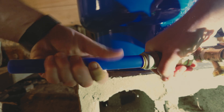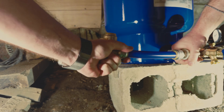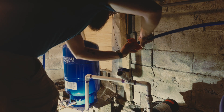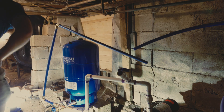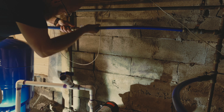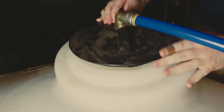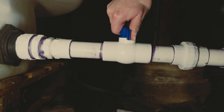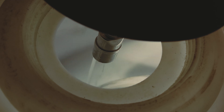I'm using PEX to go into the house. I have to double back because the house inlet is on the other side of the pump, so I'll go up and over to where that pipe comes in from the right. I'll cut in and get a nice clean end on it — it's a bit janky but it's what I have to work with. The existing PEX is thoroughly stuck into the fitting that goes into the house, so it stays. I also shortened the pipe going into the float valve, so the cistern will fill up more — I think I gained about 170 to 200 gallons. Checking that the float valve works and turning on the flow to let the cistern start filling back up.